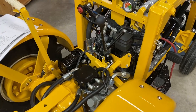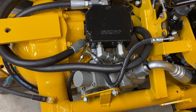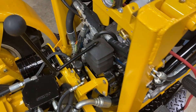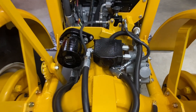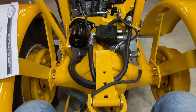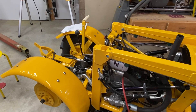I got the priority flow divider valve in. The problem was this pump is 7.8 gallons per minute running to the Prince valve — a single spool open center with a Power Beyond sleeve. That was a half-inch line going to the joystick, which is a 10-gallon-per-minute joystick. With such small cylinders installed, it was just like a catapult. I started designing this when I didn't have any hydraulic understanding, so for all you hydraulic guys out there, you're probably cringing. This has been a learning experience.